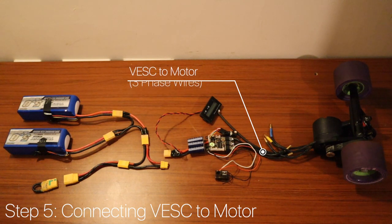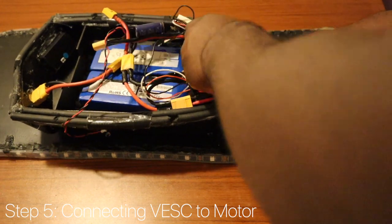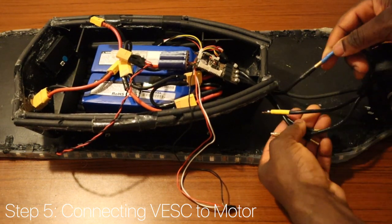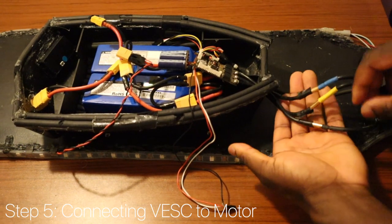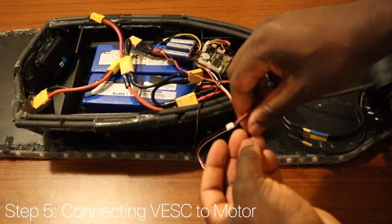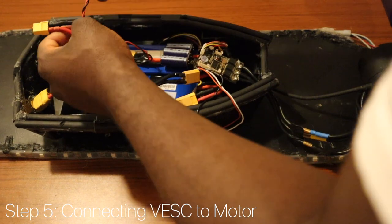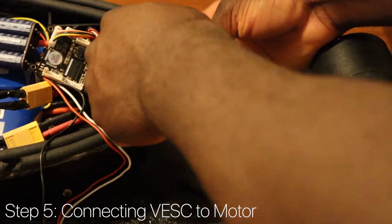Step 5: Connecting the motor. We're going to thread the VESC and plug the three-phase wires directly connected to the VESC. For now you can connect it to any wire, but it may run backwards — if that's the case, just switch the wires until it runs in the correct orientation. Finally, we're going to connect the battery status indicator to the VESC. Typically ESCs come with a remote and receiver, but the VESC doesn't — it's slightly more expensive, but a good quality ESC is definitely worth the investment.